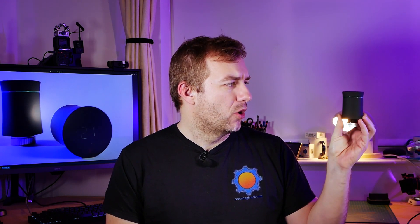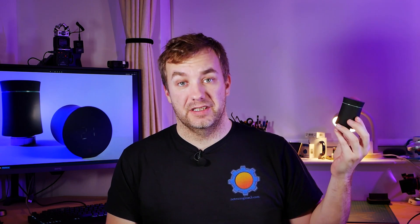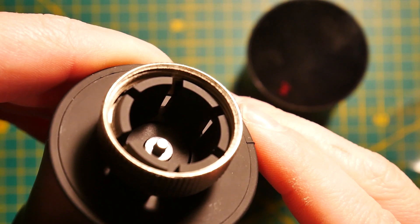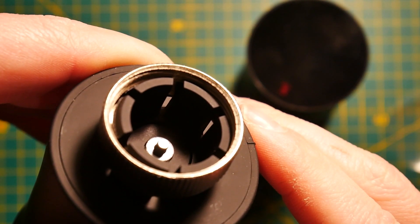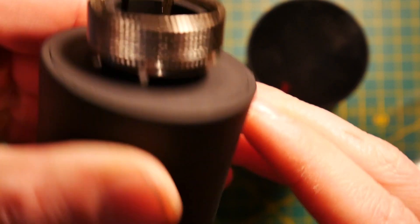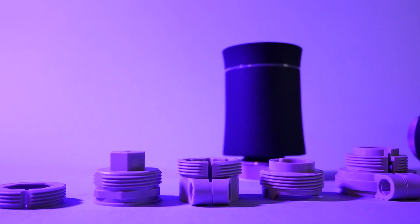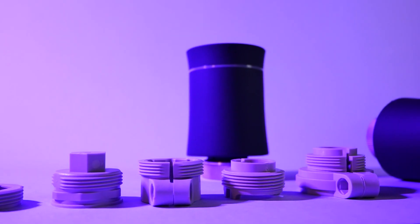This is where these TRVs come in. These are Zigbee-based thermostats that attach to your radiator. They work by attaching to your radiator's valves and driving the pin up and down to open or close the valve. Just bear in mind you have to have compatible valve types — they support six different valve types, which I'll list here, and they come with adapters.